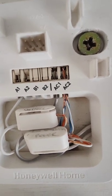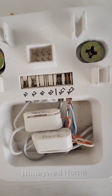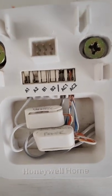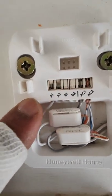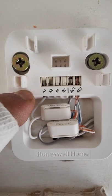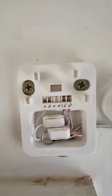Then you have the white-orange and orange pair, twisted together, coming out of the Nest Hello doorbell going into the chime connector. The white wire goes into A1, which powers the actual doorbell — so when somebody presses the doorbell button, it makes the chime ring via that connection.